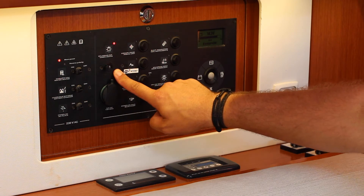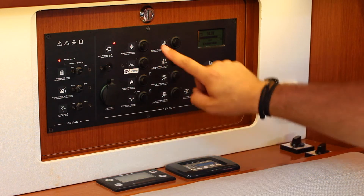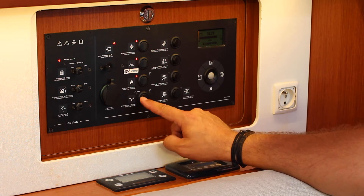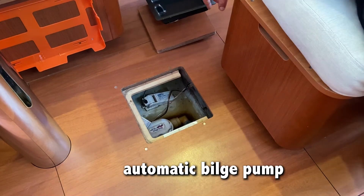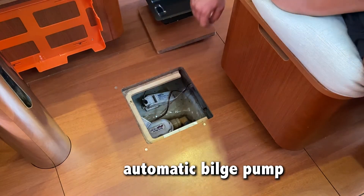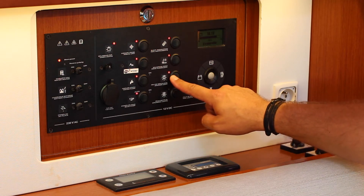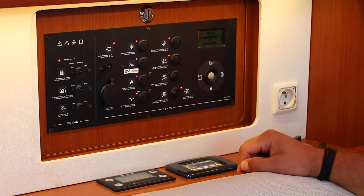This section is for the main electric cabin lights. Also on the panel: 12 volt charging, fridge, Wi-Fi internet, water pump, and bilge pump — which can be set to on or automatic. The bilge pump is located underneath the cabin sole forward of the saloon seat and is on an automatic float switch; when the float switch lifts, the bilge pump engages, and when it pumps the water out, it will stop. Your electric navigational instruments are turned on here. There is also a deck flood light, anchor light for when you are at anchor, steaming lights for when you are under motor, and navigation lights for when you are under sail.